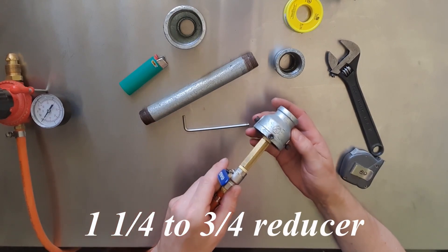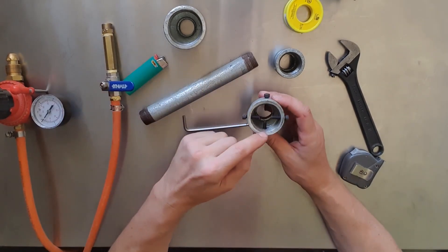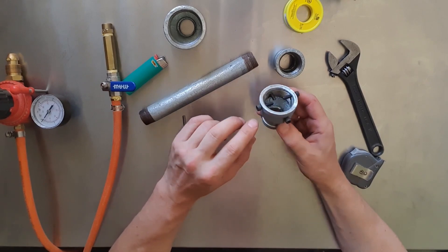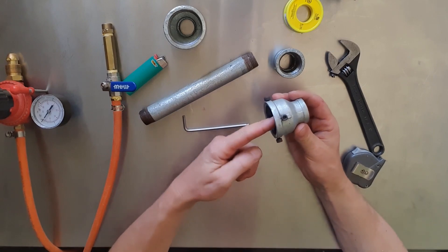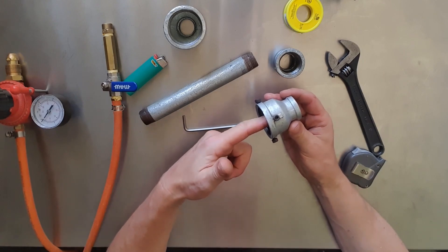The grips are on the end like so, and all I've done is drill four holes opposing each other, then stepped two of them back relative to the other two. That gives me some adjustment to make sure the gas flow is going straight down the middle of the pipe.